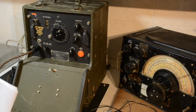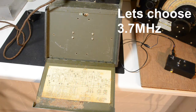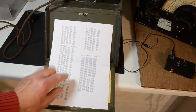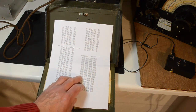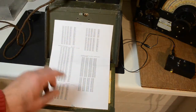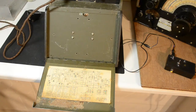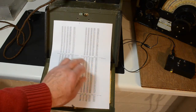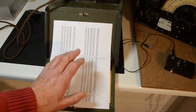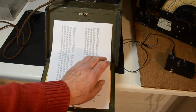The first thing we're going to do is decide on a frequency to look for on the receiver. There is no crystal calibration point at 3.7 MHz, so the closest we can come to it is 3.5 MHz, which is there under crystal calibration points. We're going to initially set the variable part up to 3.5 and cross-check it with the crystal. Frequency 3500 kilohertz — that is what we want to check with the crystal. According to the sheet, 3500 needs dial units 3359.8.